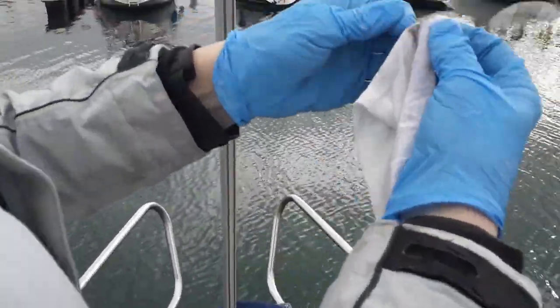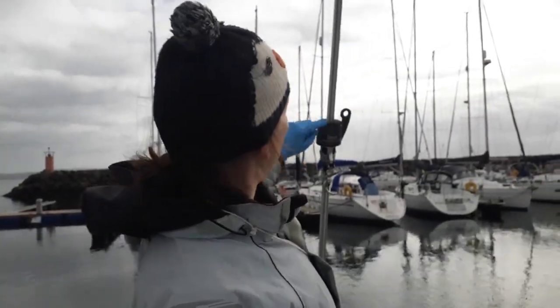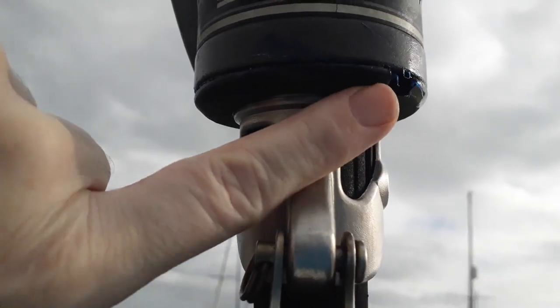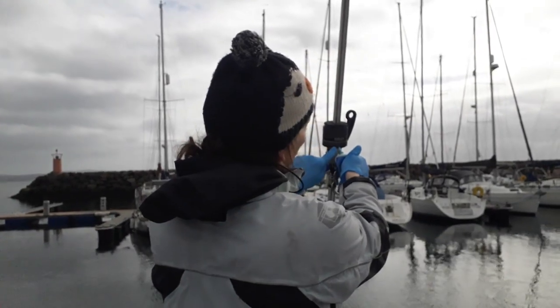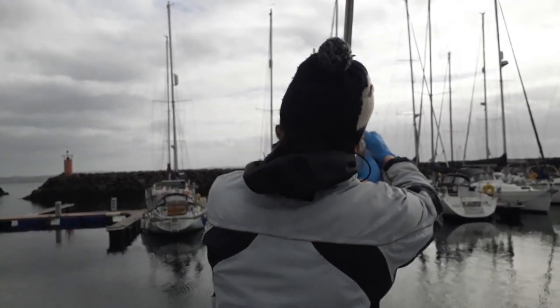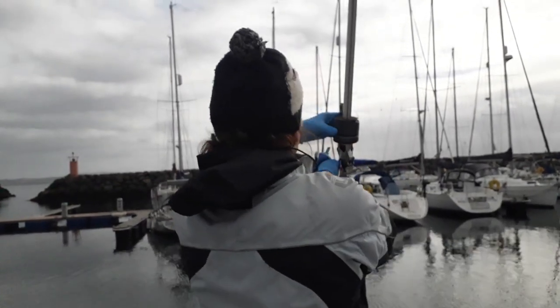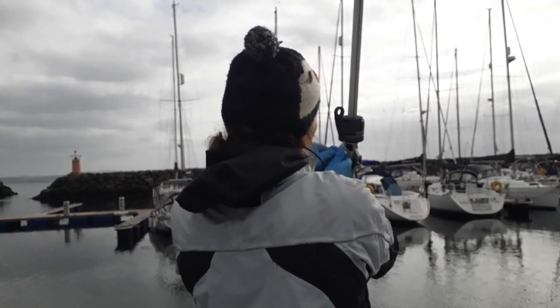Let's have a look — just a little dirty grease. When you're doing this you'll notice there's a notch here and a notch here. It's not that a bit has broken off your Furlex and dropped in the water — it's for this. That fits in there because you'll never get grease in through that tiny little gap. You basically put that in, squeeze and turn it, and that's how you get the grease into the bearing so that it runs around the bearing race.